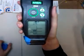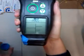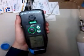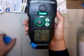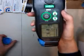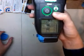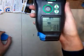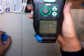If you have any questions, you can call us at Ideal Calibrations at 734-956-0539. The PID calibration came up and gave us a pass. Turn off the gas and disconnect the hose — you can watch the numbers fall back to zero. If you want, you can calibrate just the isobutylene and the PID sensor, or calibrate the four gas without zeroing first. To do that, hold down reset — it will ask if you want to zero; press reset again to skip, and it will then ask if you want to span cal the four gas, then the VOC. Pressing reset again returns to normal operating mode.